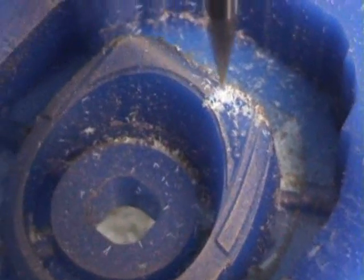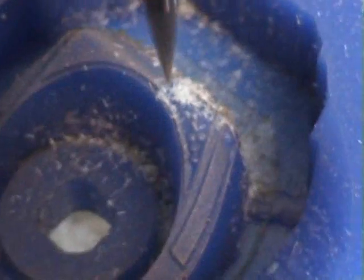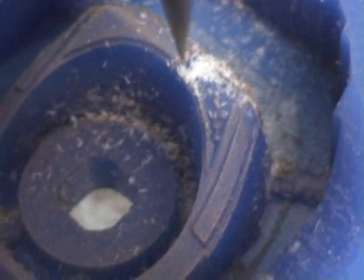The ability to index to an extracted edge is pretty good, because basically all I did in Rhino was dupe edge around all these edges with a patch and then an offset surf, and there's a blocker in place. Then you can use that same curve to constrain the toolpath without ever leaving the interface. So pretty good, but it really doesn't want to work with big mesh files, and I don't think I understand enough about mesh decimation to do big jobs like this without a little bit more study.